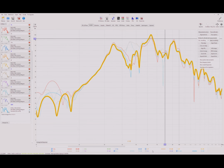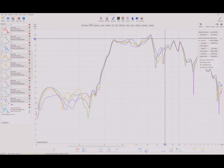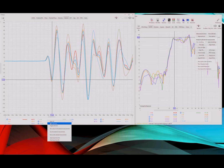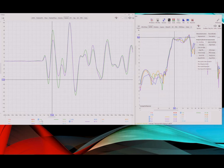Okay. Now we do the same thing for the second subwoofer. Unselect all. Select every subwoofer with 2: right, left, front, and origin. Are there 4 of them? Yes. Keep 2O selected so that it stays as the reference, and then cross correlate. You didn't see any effect here, it happened here. We have to clear selections, and these are all the 2's together. Now they are aligned, and this one stayed where it was.